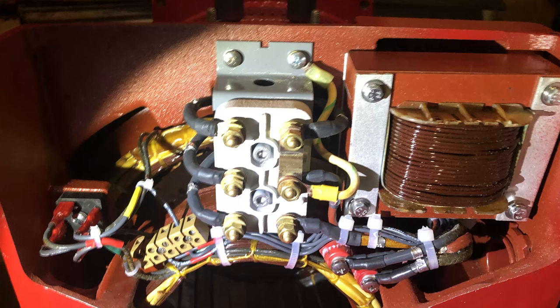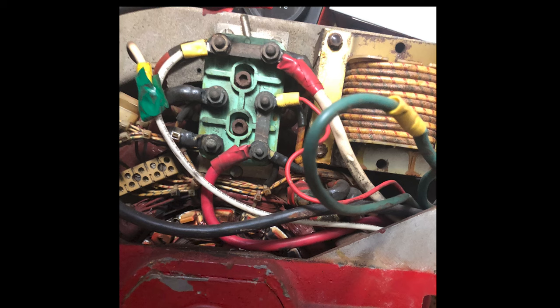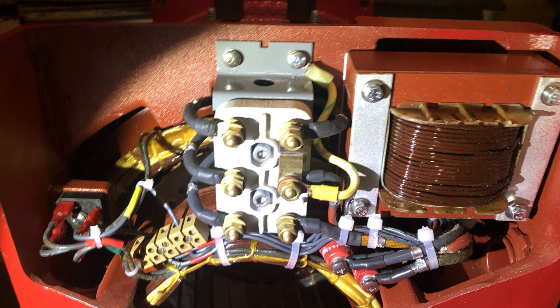You can see there are little jumper plates that you set in a certain configuration so the unit either puts out 240 volts or 120 volts of electricity. My unit is set up for 120 volts. When I took it to Broward Armature, they had the jumpers set at a perpendicular orientation—which means set up for 120 volts. But when they bench tested the unit, they had it set up for 240 volts, and that's how they returned it to me.